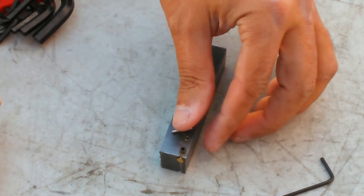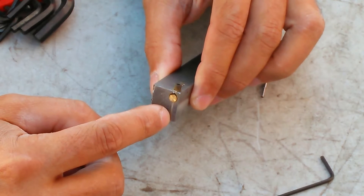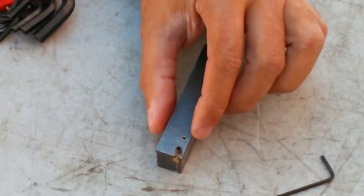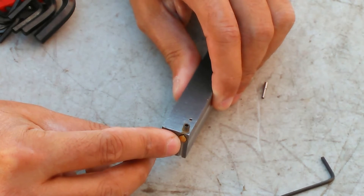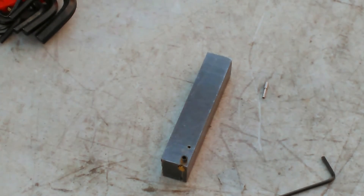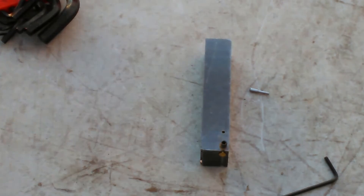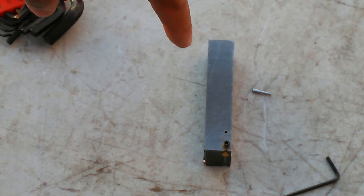I should mention that I slotted this piece on a mill. This is steel, but it's not hardened steel, so I used carbide to cut the slot — that's covered in the other video. The hole drilled through the side here is actually centered on the round piece. I always drill the hole first so it's registered, and then if I'm going to cut a slot I do that after. The hole is registered with the slot, so the hole goes in the same direction as the slot, and it's drilled latitudinally through the piece.